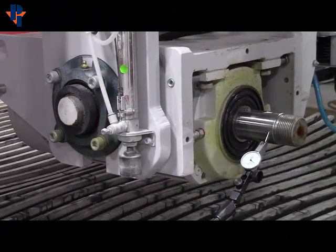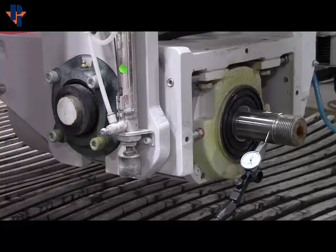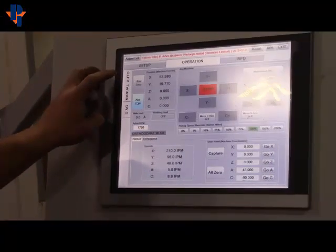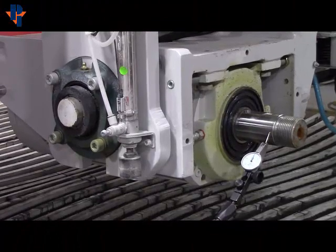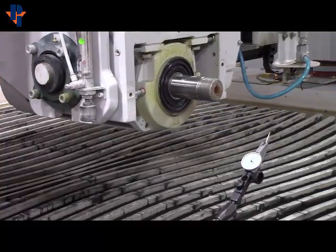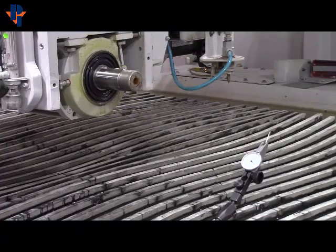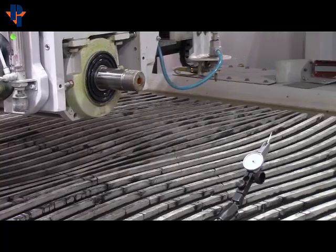For the C to Arbor, you're going to be measuring X. Drive X minus until you just touch. Sweep with the Z until you find your high spot. One thou, X minus, until you're at zero, then hit user zero to clear all these values out. After user zero, go X plus to make sure you clear everything, then Y plus — go quite a ways back, because the C axis is going to turn all the way around. Once you get back to where you can safely turn, stop. Go to the screen, deactivate the pendant, change C to 180, and turn it.